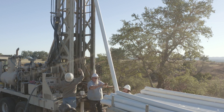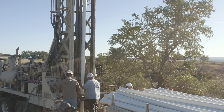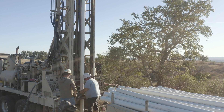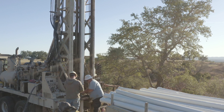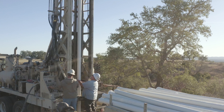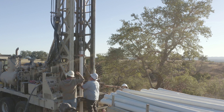Now you also have water on the inside of the casing pushing back, and this will obviously fluctuate depending upon the water level. Water levels go up and down with recharge, droughts, and pumping activities. This change in water level has played a role in the collapse of many wells in the last few years. When the wells were drilled, the water level inside the casing was high, but as more and more wells were drilled, the water levels dropped. In some cases this has led to the casing being crushed by the weight of all that water and sediment. In most cases, we have to drill a new well. As my dad used to tell me, if you don't have the money to do it right the first time, you sure don't have the money to do it over again. So let's choose a casing that can handle the collapse pressure that your well could experience in its lifetime. Now that can be a hard thing to predict, but your project manager can guide you through this decision.